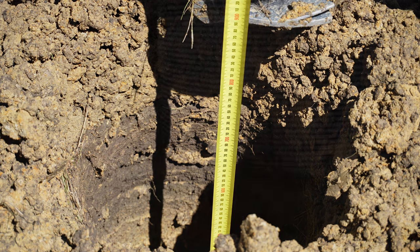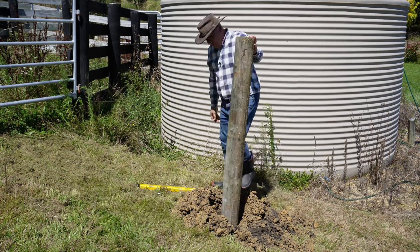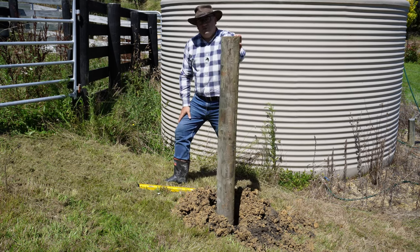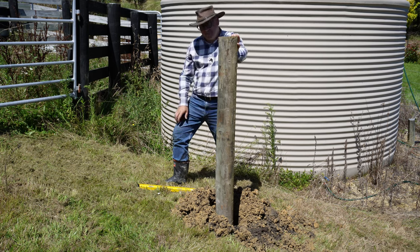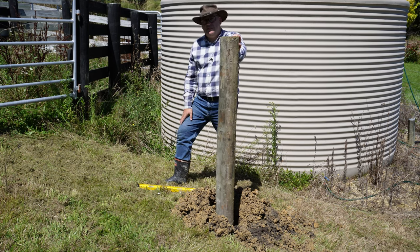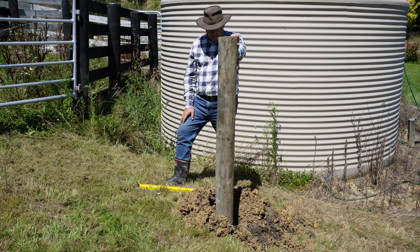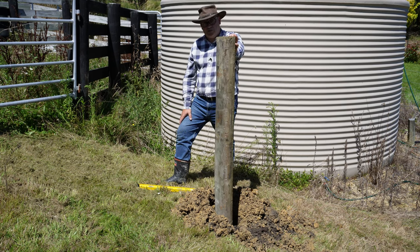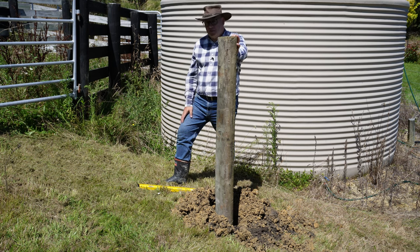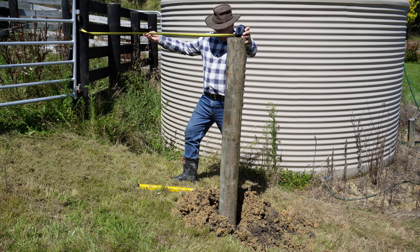Let's move everything away and we'll get the pole in. One end is normally a little bit thicker than the other. I've put the larger end at the bottom, because the bigger the foot, the more it's going to spread that load out. This is the one that's going to be pushing down into the ground. If you're concerned about it sinking, you can put some hardcore, some rocks, some bricks — something in the bottom that will just distribute that load even further. We've got our spirit level, and before I do any more I'm going to measure across here to make sure I've got this hole in the right place. Inside to inside — 2.4 metres, exactly what we wanted it to be.